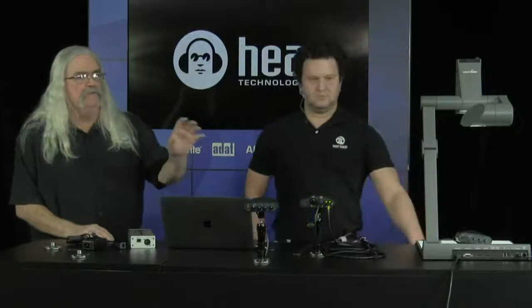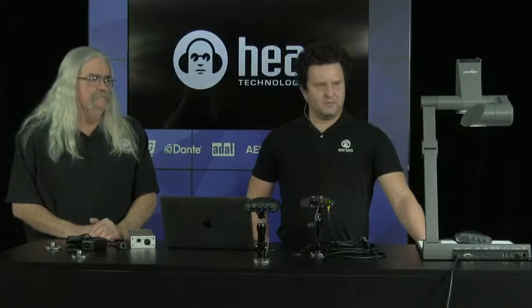One question I get a lot is that the Matrix will not link at a gig. No. Currently we're using the Ultimo chip from Dante, and it is 100 megabit. They did come out with another chip called the Broadway, and we're looking to possibly upgrade to that, which would link at a gig. So right now it's 100 megabit, but if you plug that into a gigabit switch, it's going to link. It's just going to link at 100 megabit instead of a gig.